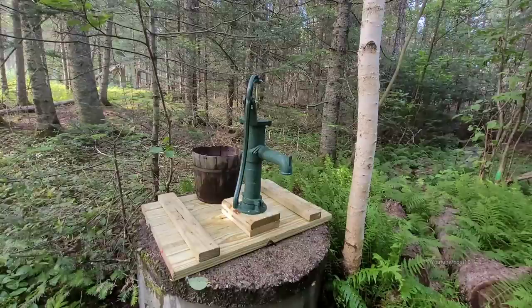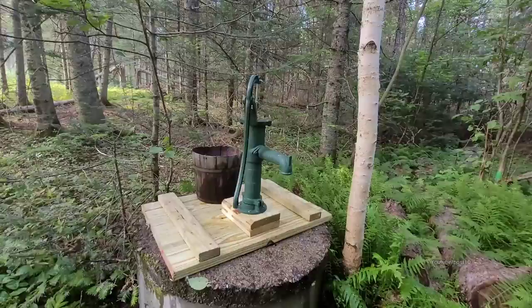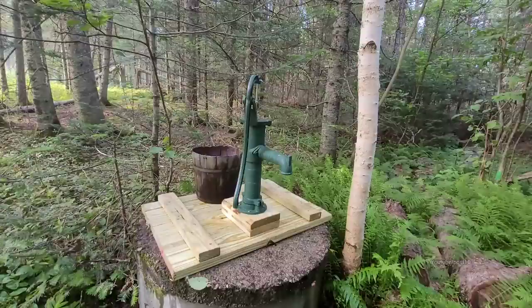It wasn't put out here for forest fires, like some commenter said last week. No, if you threw a fire hose down here, even the smaller 2-inch hose, you'd pump this thing dry in just a couple minutes. Because once it empties out what's down inside these concrete structures, it has to seep back in very slowly. So if I came out here with a 5-gallon bucket, filled it up, walked away, used it, came back 5-10 minutes later, filled up another, it gives it time to seep back into it. So it wouldn't run out in that situation. But if I had an electric pump here with a large hose, 2 or 4 inches like a fire hose, this thing would run dry extremely fast. I might be able to get away with a small 3/4-inch garden hose.